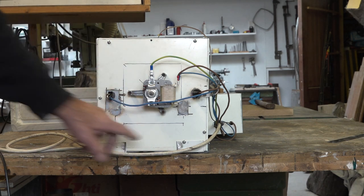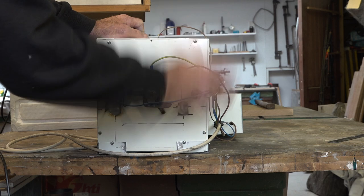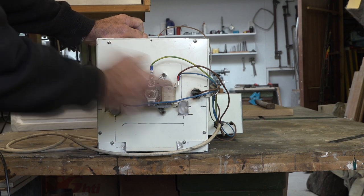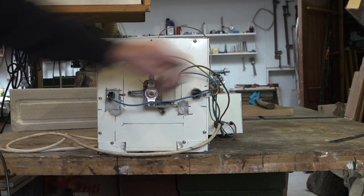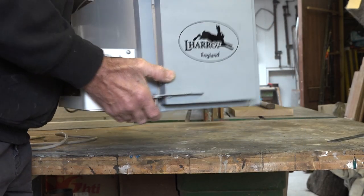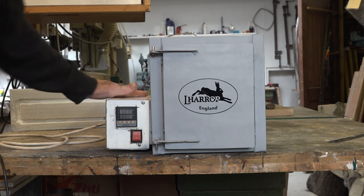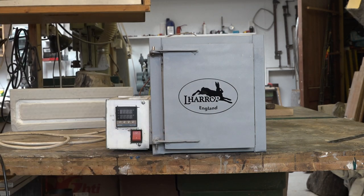That's it — just three screws in for the casing. These holes here were where the original elements came through; I couldn't be bothered making another back so I just very roughly cut out with a slitting disc and extended that to get the new placements in for the elements. There are the element connections, all running back through to the PID. The oven doesn't really weigh that much — I think there's probably about 30 pounds in weight. And that is it: my new tempering oven, which has been doing an amazing job at tempering — the results are so consistent.